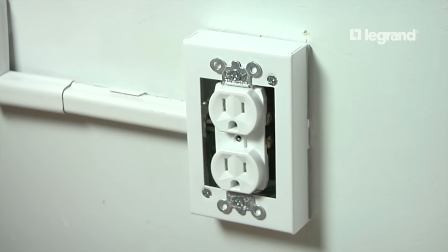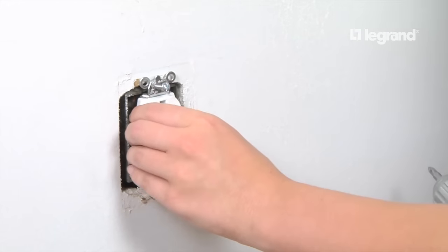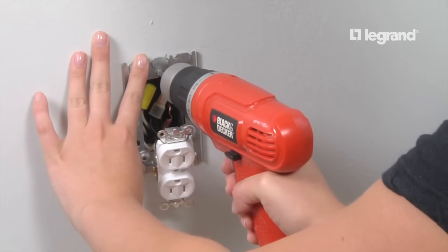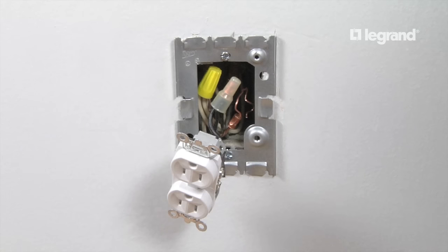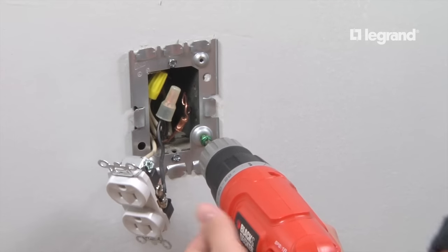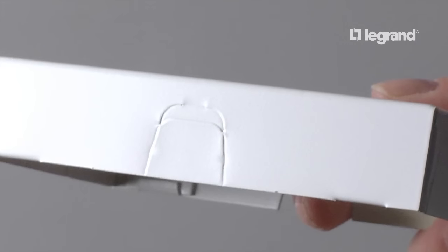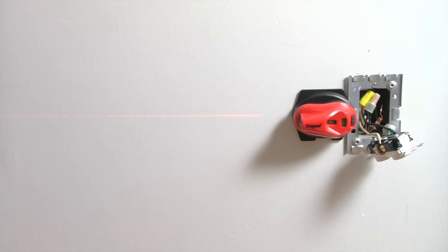The starter box typically goes over an existing in-wall outlet box containing a duplex receptacle. Remove the face plate and the two receptacle mounting screws. Pull the existing receptacle and wires through the opening in the back of the base plate, then secure the base plate to the existing box with two number 6-32 mounting screws. These wires will be connected later to the new wires of the surface mounted system. Install a number ten ground screw into the threaded dimple on the starter box base. Next, break out the starter box twist outs. Note that the twist outs are scored for use with either standard ivory or high capacity white series — make sure the knockout matches the raceway profile used in the project.